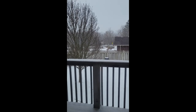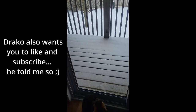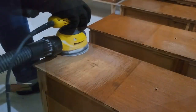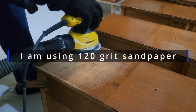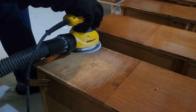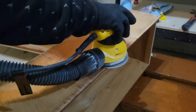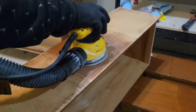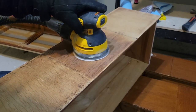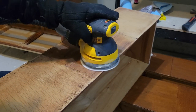This is why it's so cold in my garage — you can see my breath out there. Once I warmed up a bit inside, I went back out to the garage to start sanding the drawer fronts. You can tell that someone else had previously refinished this because there are swirl marks from a sander that I will have to get out. You want to make sure that you are sanding with the wood grain — if you don't do that, you can get splotchiness with your stain, so always sand with the wood grain.